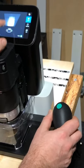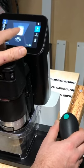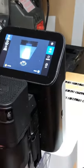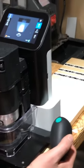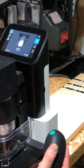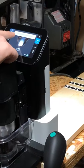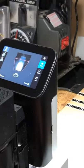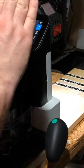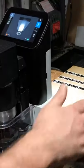This picture here shows you what the camera can actually see, and it highlights the shaper tape dominoes in blue that it finds. So you're going to move around on your workspace, trying to get everywhere that you want to cut to show up on camera at some point. If you come back far enough that it can't see enough shaper tape, then it's going to go red around the edges, and it's going to stop recording. Now it gives you a notice that you need to orient it towards shaper tape. And again, while you're doing this, you're keeping it flat on the surface because it's using the tape to figure out the distance, to figure out where the surface actually is.